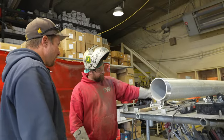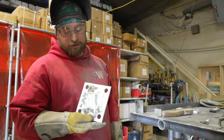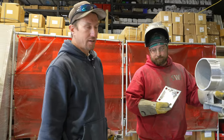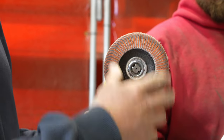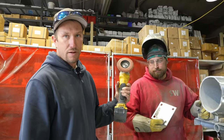Next step: go get a plate. These are already pre-sanded and marked out for square. To take the galvanizing off of the 6x6 base plate — quarter-inch thick — Nolan has used a flap disc on a cordless 20-volt DeWalt grinder.